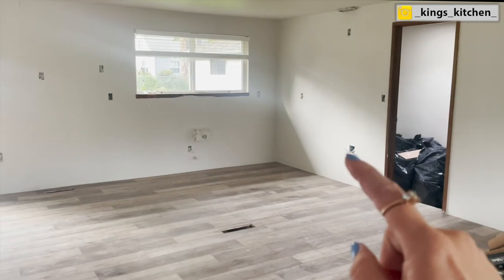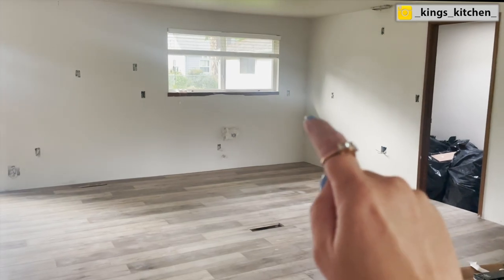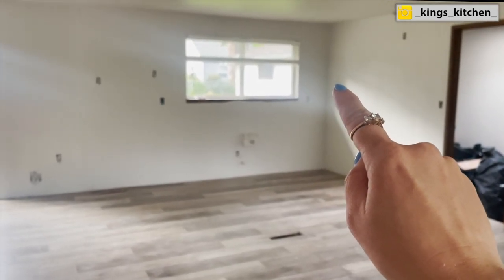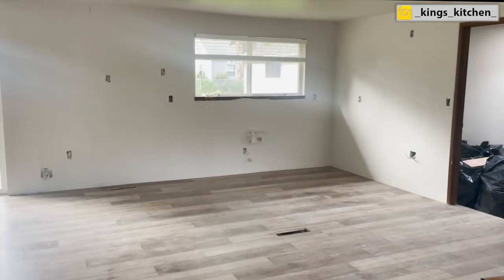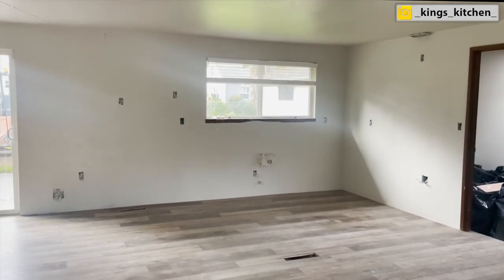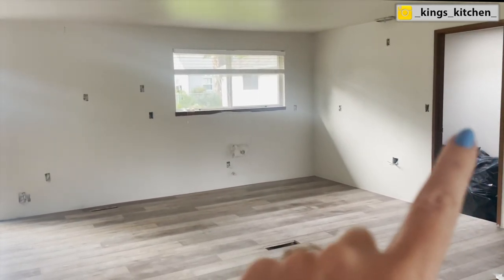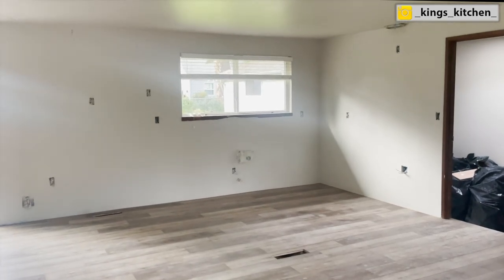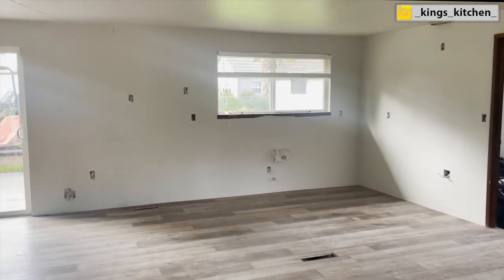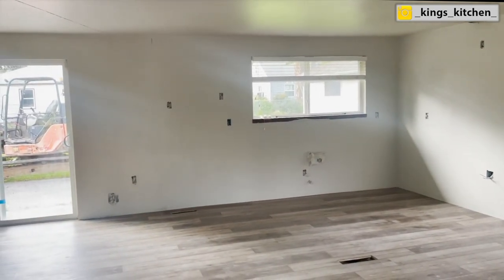When I'm measuring for a door, I'm measuring the outside trim of that door. This space I measured from the very corner to the outside edge of the wall. Then you measure from the corner to the corner of the window. If this window had trim on the outside, I'd be measuring to the outside of the trim — from the outside of the trim to the outside of the trim on the other side. In this case we don't have trim, so I'm just measuring corner to corner, and then from this corner to the very end of the wall.